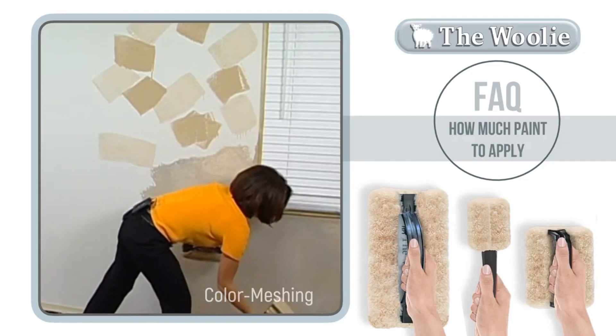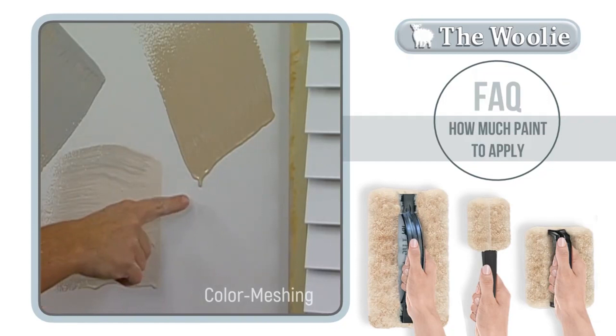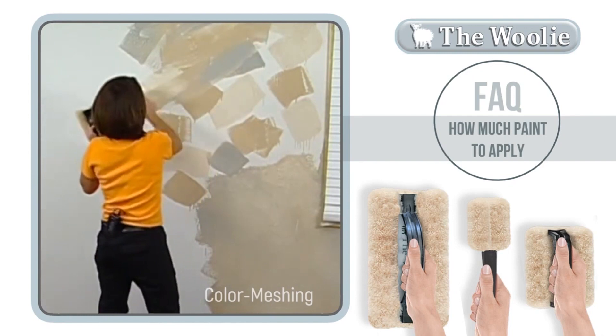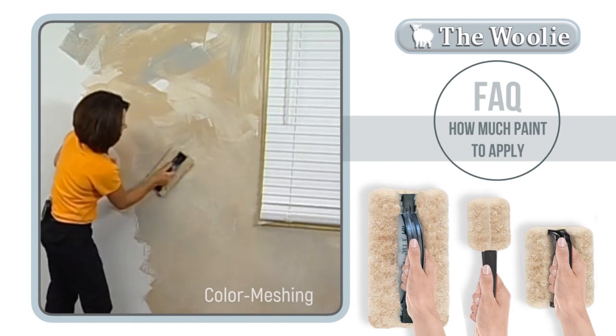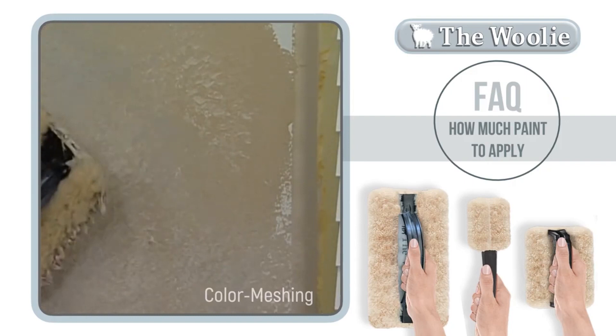Now watch closely — the paint actually begins to drip on the wall. Once my paint's on the surface, take the brush and spread the paint out. There's no magic or special talent required. If you find yourself along your edges or corners or ceiling lines, run your brush along there. Then take the Woolly and stipple it down so that it makes a nice transition. Notice how the edge snuggles right up next to our edges, corners, and ceiling lines, so we don't need other little tools to fit along these areas.